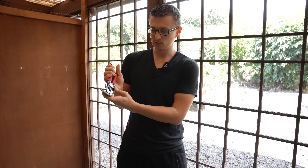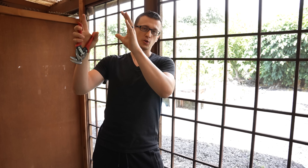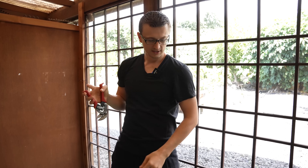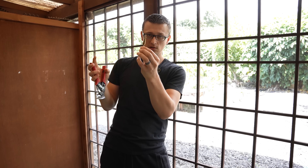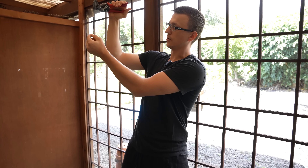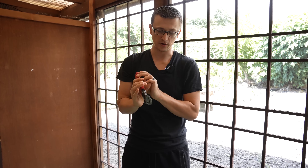The purpose of this tool is mostly to cut ductwork that's already installed. So, for example, if you're installing a humidifier on a return duct and you need to cut out a circle, these are really nice. You take a multi-bit, drill a hole, and then you can just stick them in there and start cutting out your hole with these 90-degree offset tin snips. They work very nicely for those kind of situations.